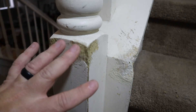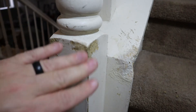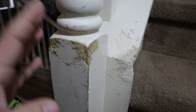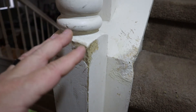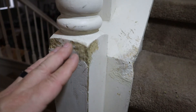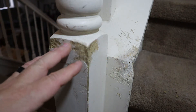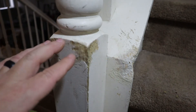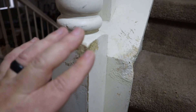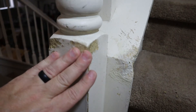The process is going to be the same: sand it down, get rid of any loose wood fibers or dirt, do the wood glue, and then the wood putty. But between wood putty applications, I'm not going to sand in between — I want to leave it rough so the subsequent coats build upon themselves and adhere better. But I'll still do wood glue between the coats. I'm going to start with 120 grit and then start building this area back up.